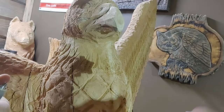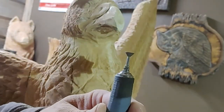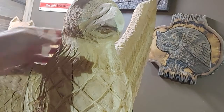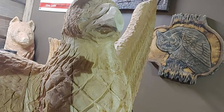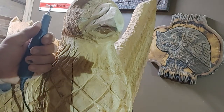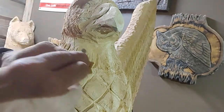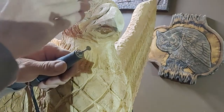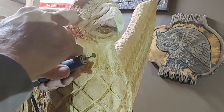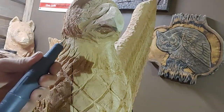Let's pop that one out and pop this one in — this is the diamond inverted cone. We're just going to do some real nice cleanup and see what we can do with this one. I've used diamond burrs before but didn't have this one until Bare Woods gave it to me to show you. It's got a safety face, so we should be able to roll it over the eye and kind of plane out those rough edges and make a more natural look.